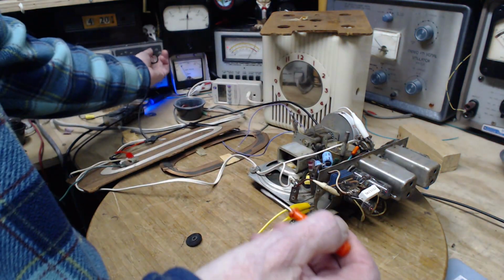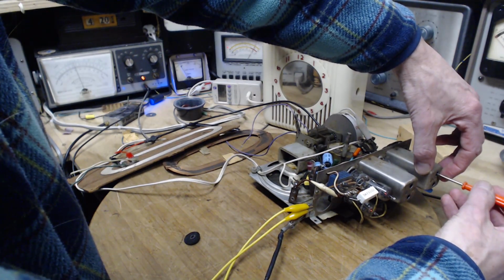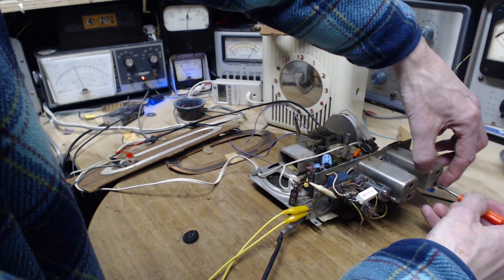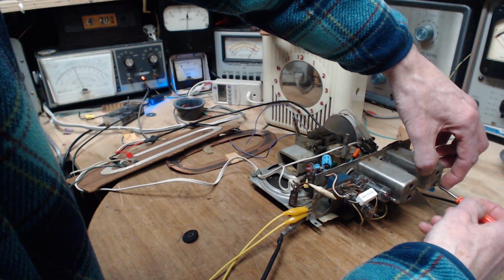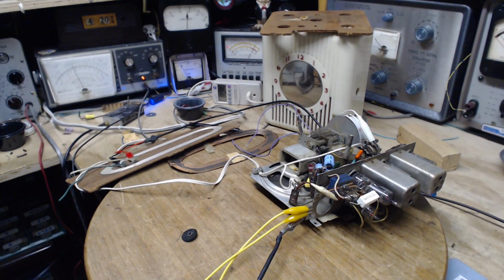And we're going to turn down the signal strength here. It's maybe a little too low. One of these two it was. This one. Okay, so this one's at its peak now. So one slug was out, and I think maybe I had done that to quell the oscillation. I can't remember. But there's no oscillation now. Wow, that raises a lot of interesting questions. Was that oscillation because of the high heater voltages?